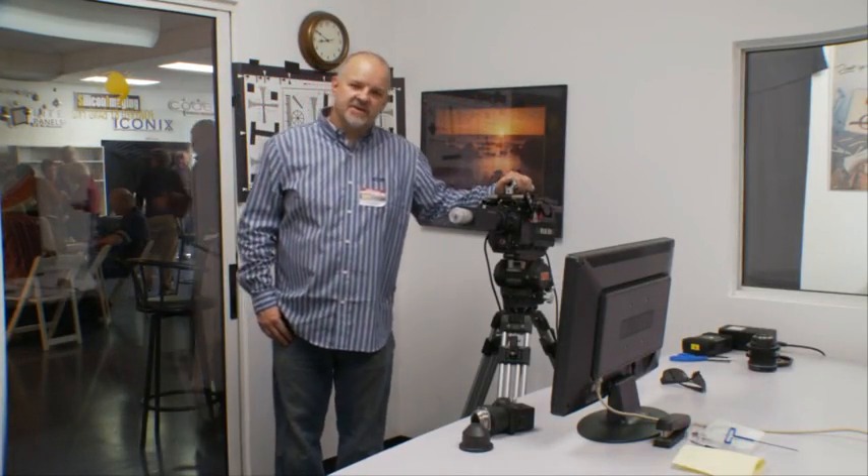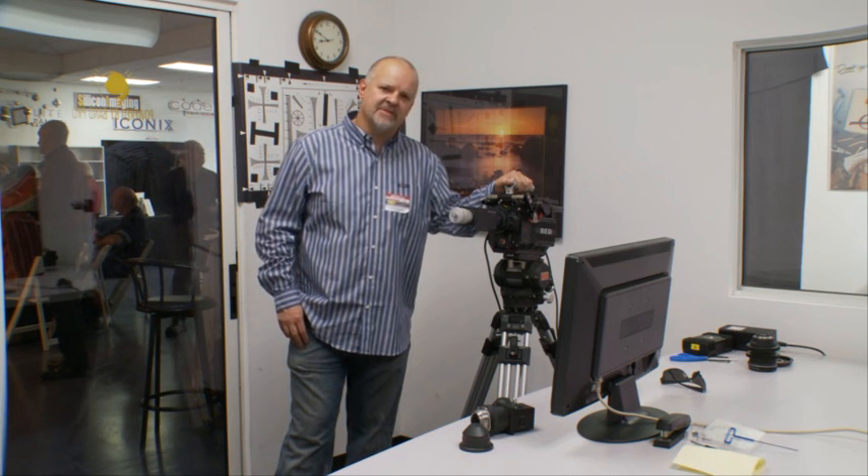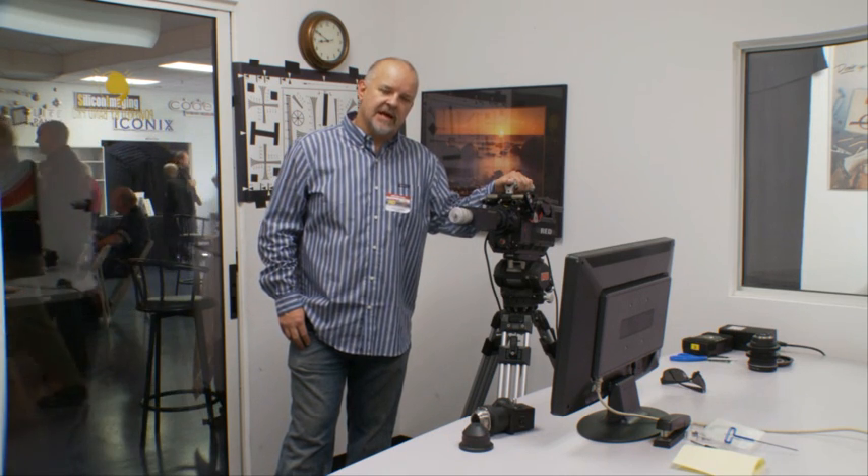Hello, my name is Jacek Żakowicz and today I would like to introduce the Optitex Optimator, which is a tool that allows for running various tests on digital cinema cameras. It works on the principle of projecting a fine resolution target onto the sensor at a very precise distance, which allows for one of the tests to be a back focus check on the camera. You need to do that in order to have your lenses in focus when you're doing production.